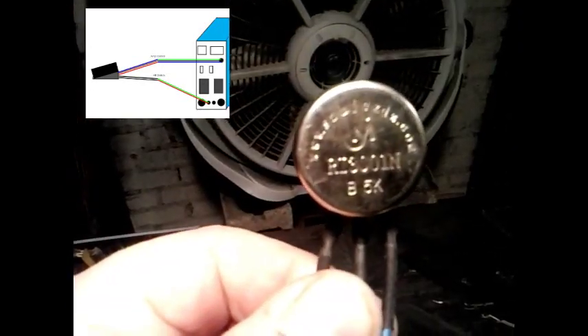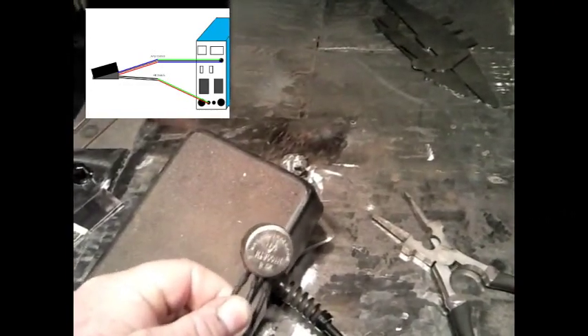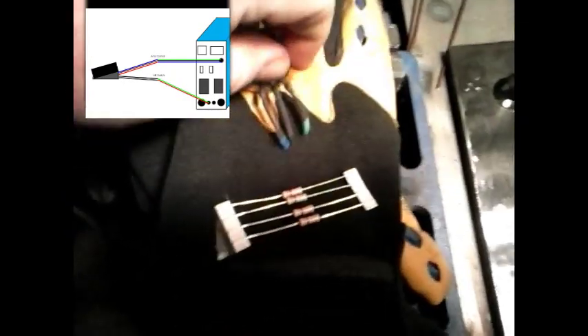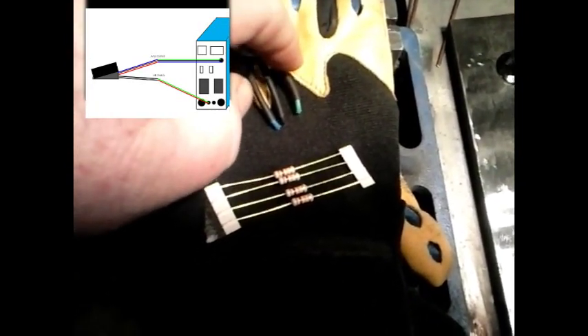The one thing is, this pedal has a 10,000 ohm pot in it, and the one that came out of the machine is a 5K pot. I could have tried to disassemble the pedal to install the original pot, or buy another pot. But the simplest thing to do was to cut the 10K potentiometer into a 5K potentiometer using a single 10K resistor, which cuts the potentiometer in half. All you have to do is attach the resistor across the outer two lugs — not the wiper — of the potentiometer.